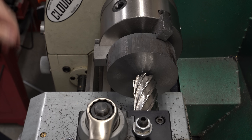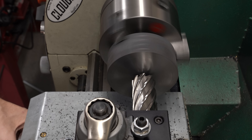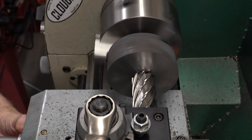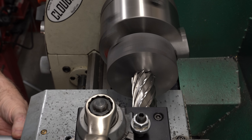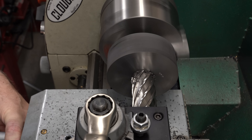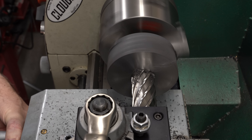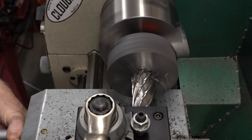It's actually three and three-quarters inches in diameter. I took it over to the band saw, cut off a slice a little thicker than needed, and started by facing it off. I can already tell that the six-bolt clamp I made for the compound on this lathe is making a huge difference — that cut was way smoother than I've ever seen this lathe run with the compound on it.